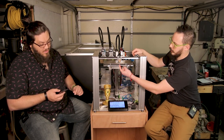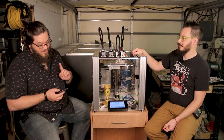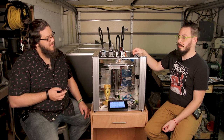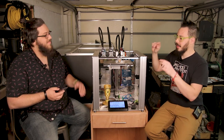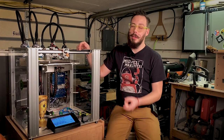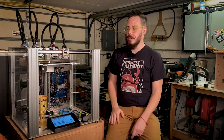Am I correct that a Z probe is on the carriage? And you maintain tool offsets in the G code, issues around Z probe with Duet 3 mainboard only. You don't do Z offsets in G code. You do Z offsets in config G code, I guess. It is there. Tool offsets in Duet or RepRap 3, they're not an issue. There was an issue with multi lead screw leveling. That's fixed. Okay.